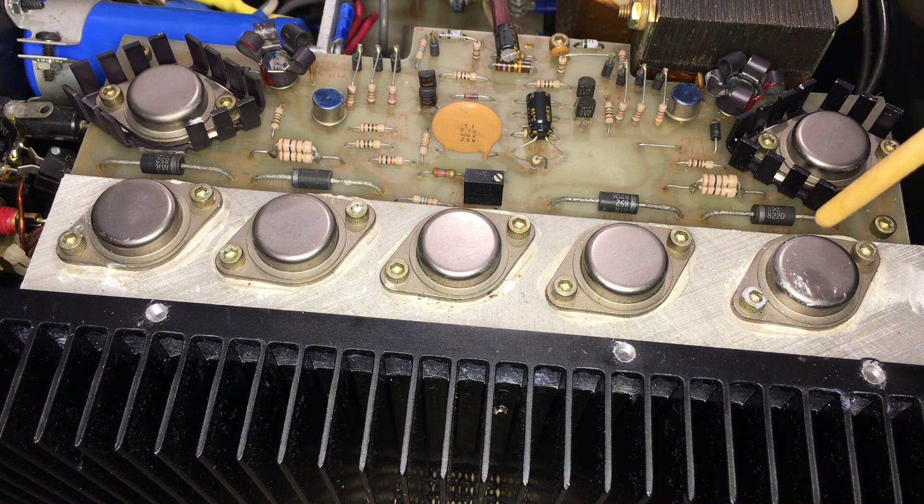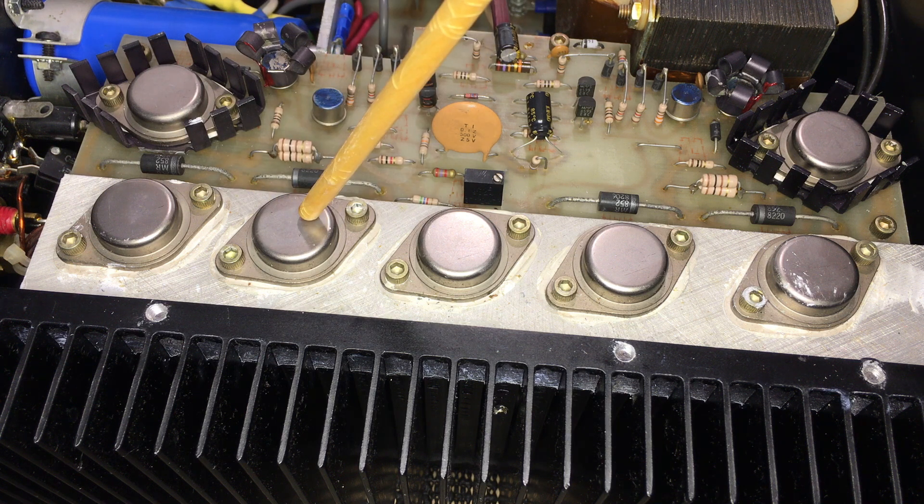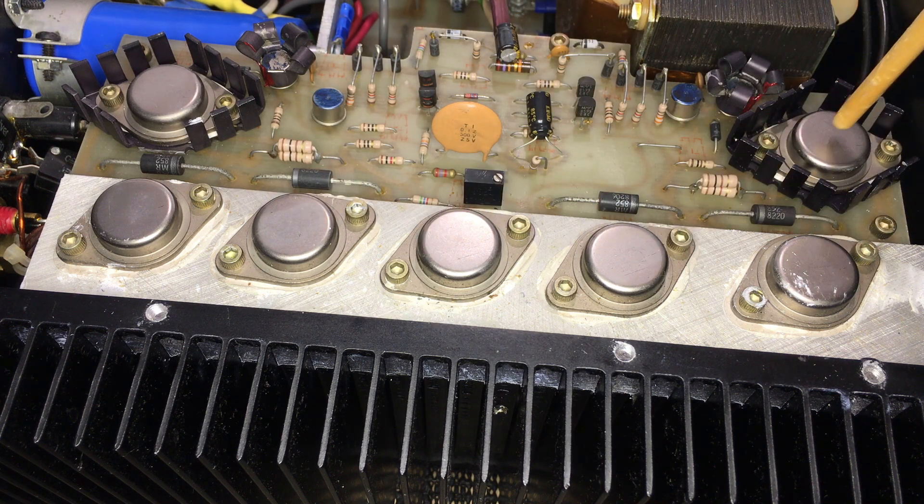The unusual part is that there are three more transistors here. According to the schematic, these are also 2N3055Hs. That's not normally the case, but it does make maintenance easier. I believe two are in parallel on the top of the waveform, two for the bottom, and these are pre-drivers. There are a few more CAN-type ones which I believe are 2N5416s, plus a couple of small ones. There's a strange arrangement here too — three resistors in series with a diode, and there's another lot like that.